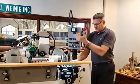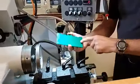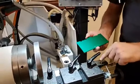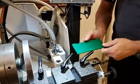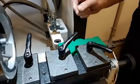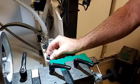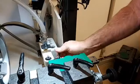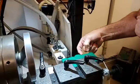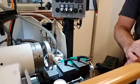So when we, let's say we put our cutter head on, we're going to do a resharpen. We simply take the template, and they all are always marked face up and where we have a reference of which side we're supposed to push towards the pin, whether it's a top or right, or left or bottom has its own setting pin. So we simply push that in, bring it over until it stops, and then lock this item down. Okay. Then we place the tracing pin in, whatever size it may be, and then align the edge of it and lock the tracing pin in. So now we're just going to be following that profile with this tracing pin on the edge of the template itself.